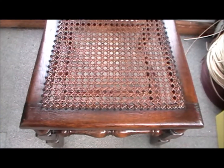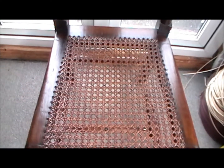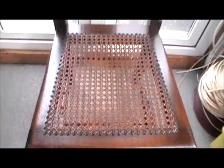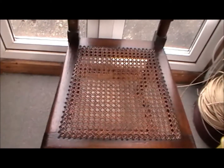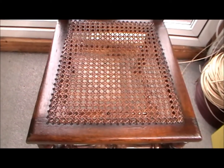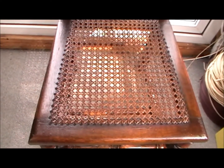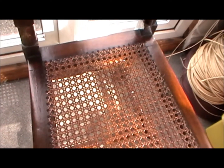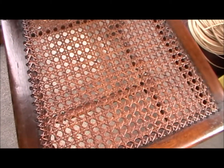So while I'm waiting for that to dry before I can do any more, I thought I'd come back to show you this. I've finally finished this off first thing, and as you can see it's pretty dried up okay now and I think the colour matches okay. All I've done to finish this off was check it was dry first thing this morning, then I went over it very quickly with a layer of shellac french polish just to make sure it is totally sealed in. And look, just in time the light comes out so you can see — I think that'll be fine.